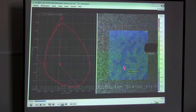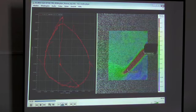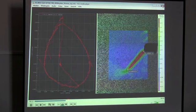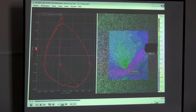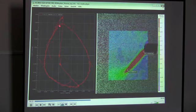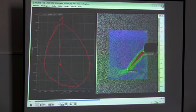On the right-hand side now, I have plotted the XY stresses. So this is now mode 2, what we can observe at the surface. And on the left-hand side, no longer the forces and moments are plotted, but the strains epsilon YY over the strains epsilon XY. And you see what happened to this original ellipse if you apply simply these loads.